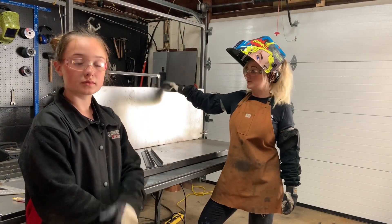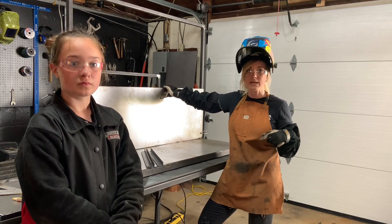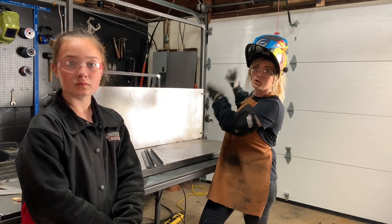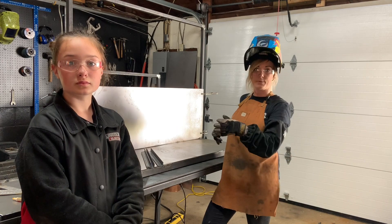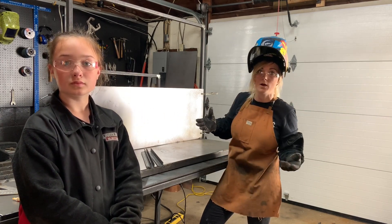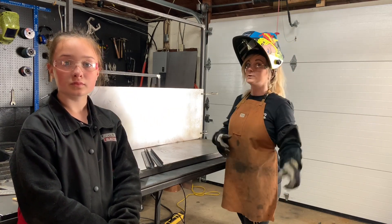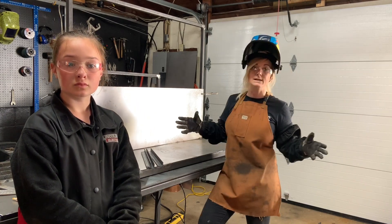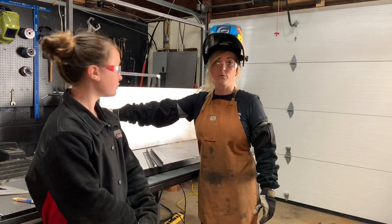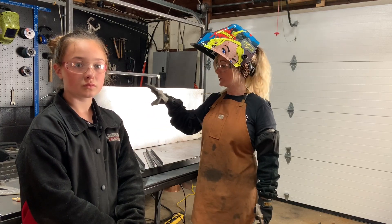The sheet metal rails are welded to our cart and now it's all sectioned off. It's time to bring in the sheet metal pieces and angle to make our scrap bin and our longer length bin. My scrap bin is going to be a little bit bigger than the drop bin because I have more scrap than drops a lot of the time. Feel free to adjust those sizes at home. We have some angle here to help with reinforcing the corners of our sheet metal to keep it nice and secure.